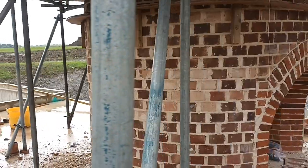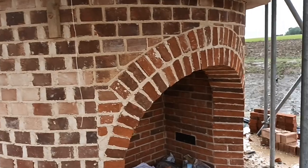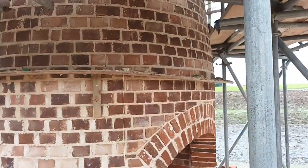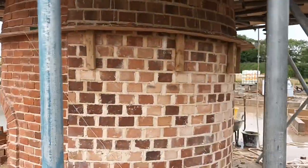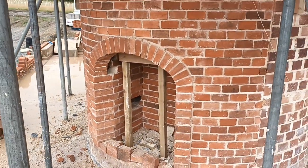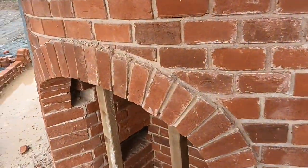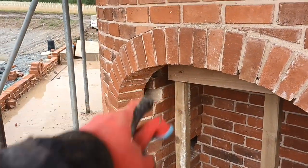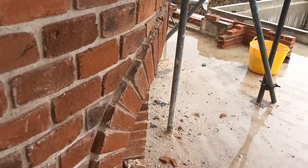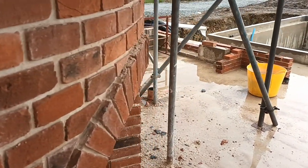We come right down to ground floor — we did a nine-inch on the ground floor, so perhaps a bit bigger obviously. Then we have the nice little arch which will get rendered, this will all be rendered, and then Bill will come in and parget his face on there. This is the outdoor area — still needs a little bit of tidying up, but George and Jake have done a lovely little job on this arch. A little three-centred arch on a curved wall — I think the lads did well on that, it's very nice.